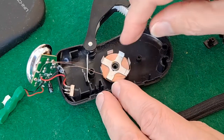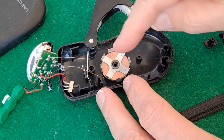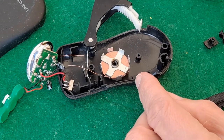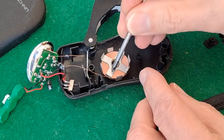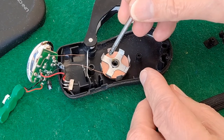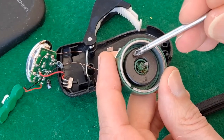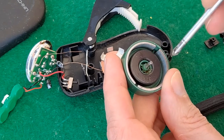It spins over that coil, and those sort of cross pieces there are to take the spinning magnetic field — so it has four negative poles and four positive poles, I think that's the best way to put it. The opposite sides of that coil. I don't know if I'm explaining that clearly enough, but the magnet's spinning horizontally, and each of those metal plates which are ferrous act as poles for the coil. So as I just said, if that's a positive that would be a negative, that would be a positive, that would be a negative and so on.